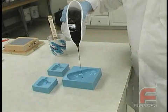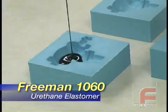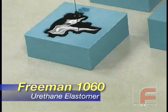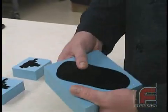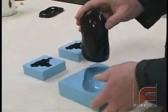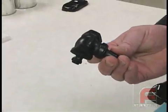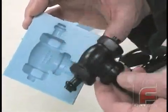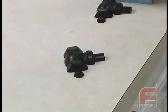When pouring a polyurethane elastomer mass cast material, it is important to begin at the lowest part of the mold and pour in a narrow stream to avoid creating new bubbles in the mixture. The thinner stream also helps when directing the pour into intricate patterns. Since we are using a silicone rubber mold, it is easy to flex the mold to remove the cured part. Notice that the smaller model isn't as shiny because the master model used to create the mold isn't as shiny — this shows you how well the silicone rubber transfers the surface features of your original part. This model also displays the flex in our Freeman 1060 urethane elastomer and its superior impact resistance.